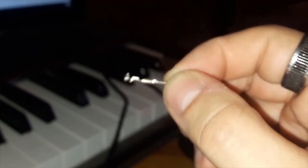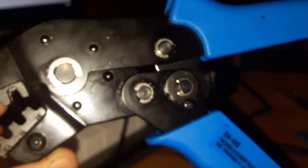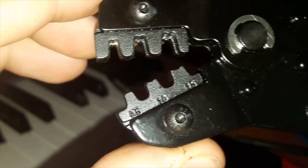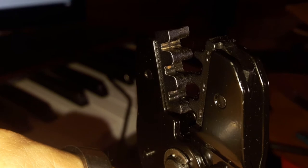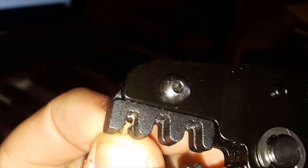Now let's take a look at the tool itself. There are a ton of expensive tools out there, and in all honesty this one is probably far from the best, but it only cost 15 bucks on eBay and crimping isn't exactly a precise science anyway. You can see four teeth, or rather three gaps, the smallest one labeled 0.5. If you look at it from an angle, you'll notice each gap has a wider half and a narrow half. That's because crimping is done in one step for both pairs of wings. As you press the connector inside the gap with your thumb and slide it down, you'll feel the larger wings hit the edge between the two sides — that's how you know the connector is in the correct crimping position.